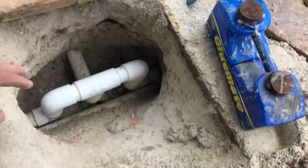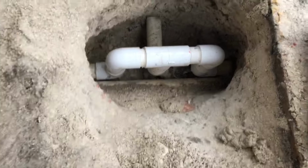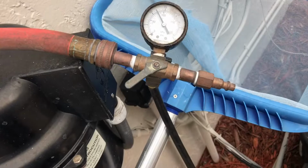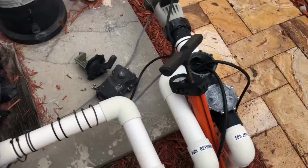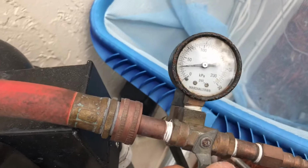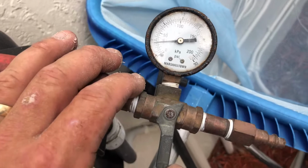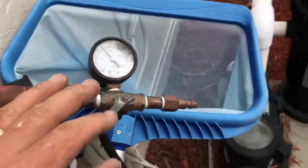We're gonna repressurize the pipe to ensure that we have a solid, positive static test going on here. This is a good job. We are adding water back into the plumbing to repressurize the pool returns. So far, so good. We're gonna build it out to about between 8 to 10 pounds. And that's a very good sign. We have no other leaks. Let's go check out our hole.